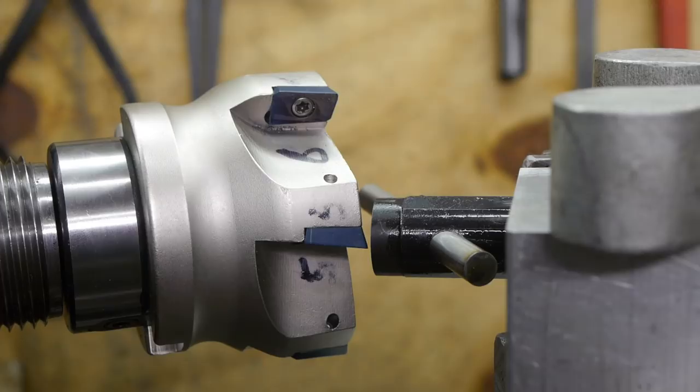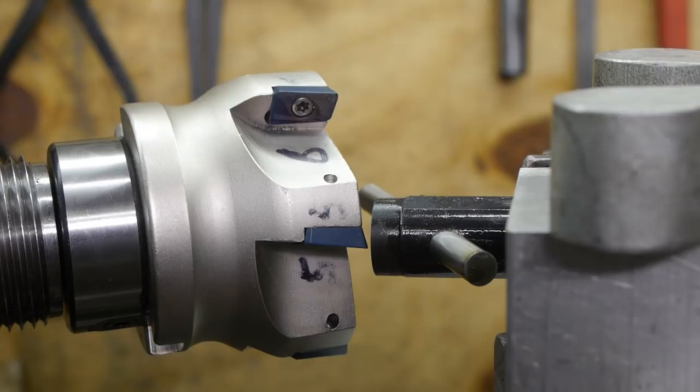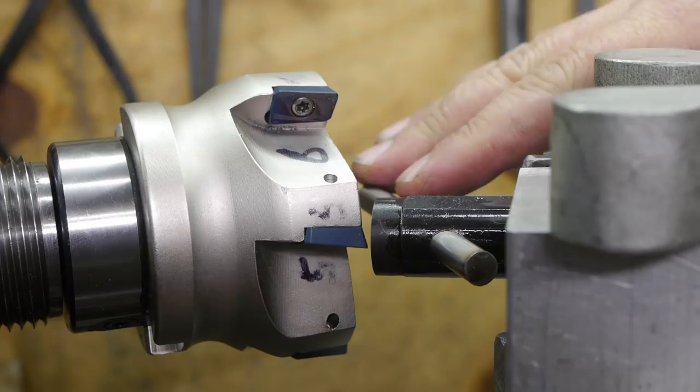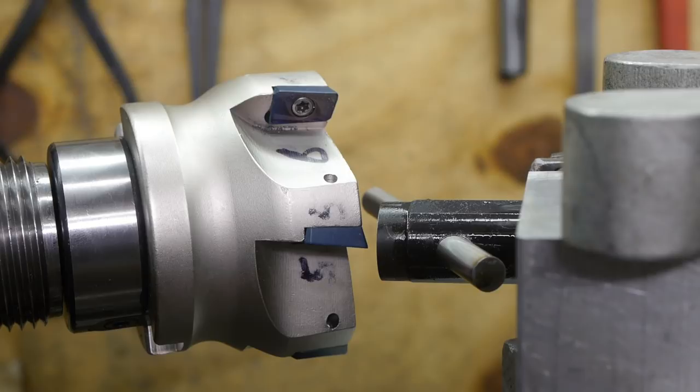I just lined up the face mill with a pin using a metal plate to set it parallel. It's not perfect, but it's good enough. I had to flip the fixture upside down, and so it's no longer on center, and that is why I'm using a face mill and not an end mill. I know it's a bit of a dodgy setup, but I've done it before, so I know it should work. Although that's no guarantee.